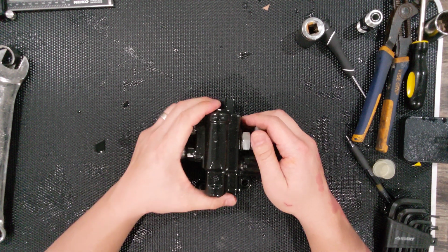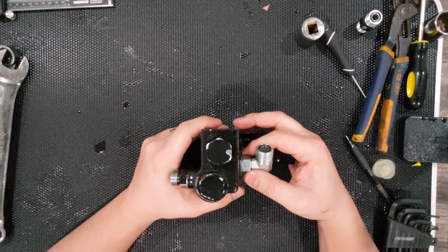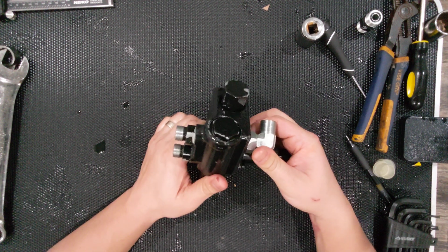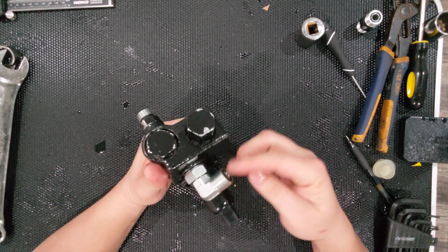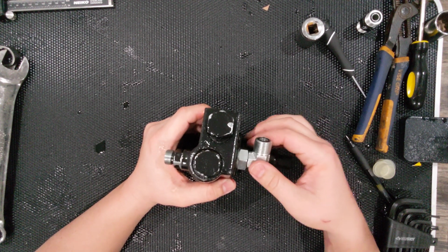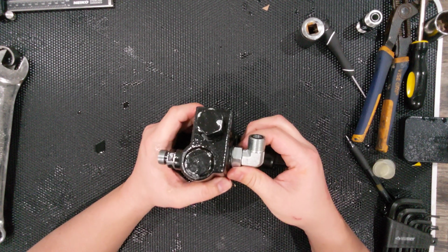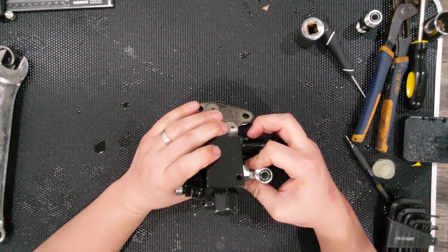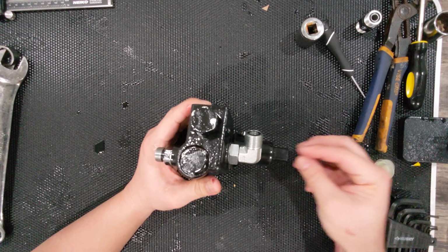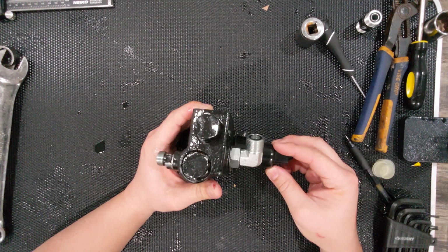So with the John Deere, this is the key to separating a single positive displacement, fixed displacement pump into 2 separate flows. And if you see here, the input of this, and this is not actually factory, I have used this on a different part of the setup, so I'll put one of these on. This is just a Parker Hannifin connection, but it's exactly the same. This is how you would see it in the configuration if you've looked closely: there's a connecting wire here that goes to the PTO switch. This is what actuates your PTO.